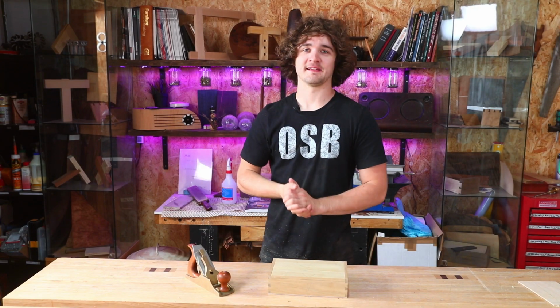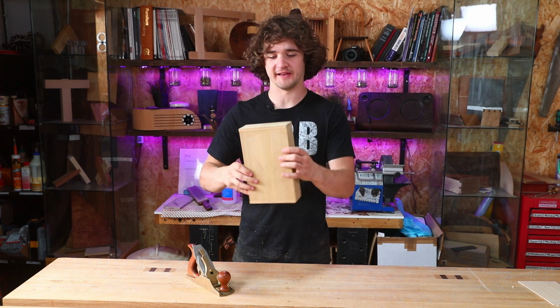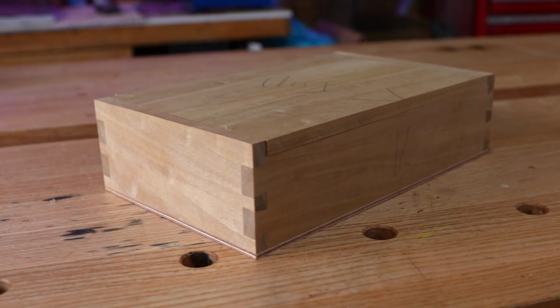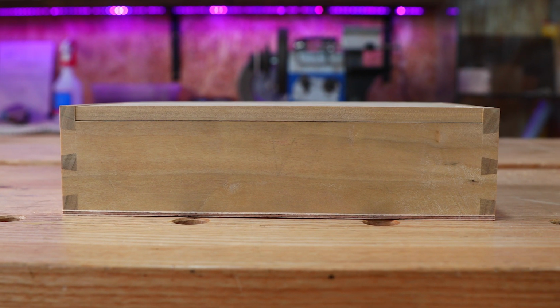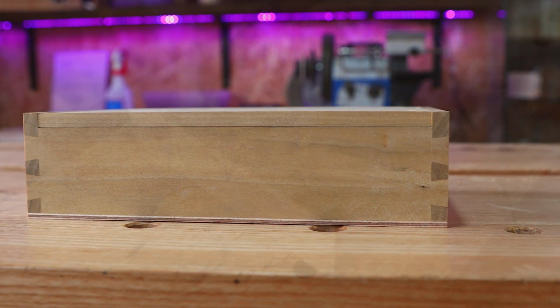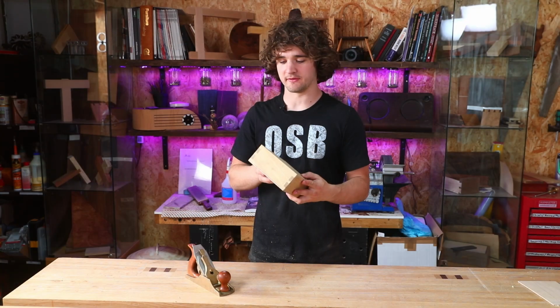And there you go. That is how you size and flatten the lid to fit within the top of the box. Now, we are going to be cutting rebates on this lid in the next video in order to locate that front to back movement. The lid is not going to stay loose like this. So you'll be seeing that in the next episode, as well as planing down these top edges so they're flush with the top of the box.